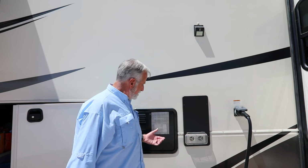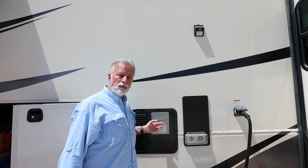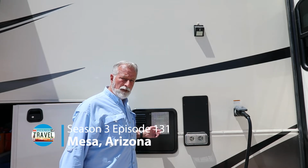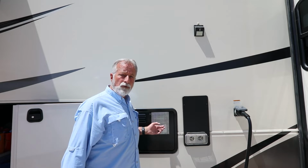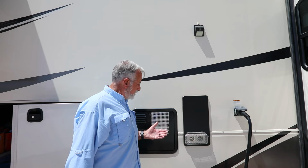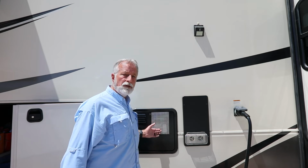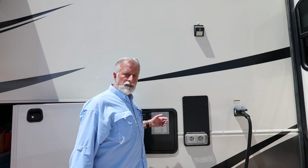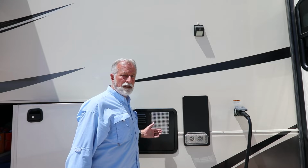Today we're doing a little preventive maintenance, and that's going to involve working on our water heater. We're going to change the anode out in it, and we're going to flush it. To flush it, we're going to use about half the volume of this water heater with vinegar and the other half with water, a diluted solution, so that we can clean the scale that builds up on the inside and hopefully get rid of some of the sediment to help prolong the life of the heater. Not just the heater, but the tank itself.